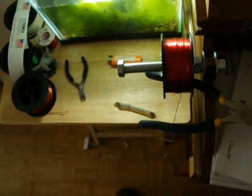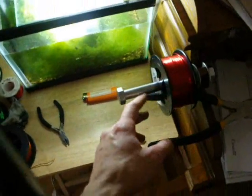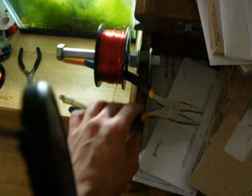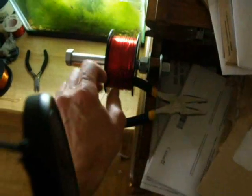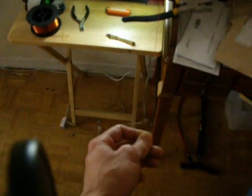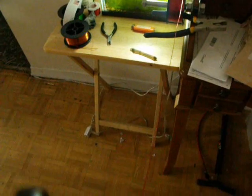Here is the holder for magnet wire I used for winding. The bobbin is held on a screw which is mounted on a table, with pliers that don't allow the bobbin to rotate. This lets me stretch the wire and keep it under tension during winding with some pulling force applied, allowing me to wind the coil in a very dense way.